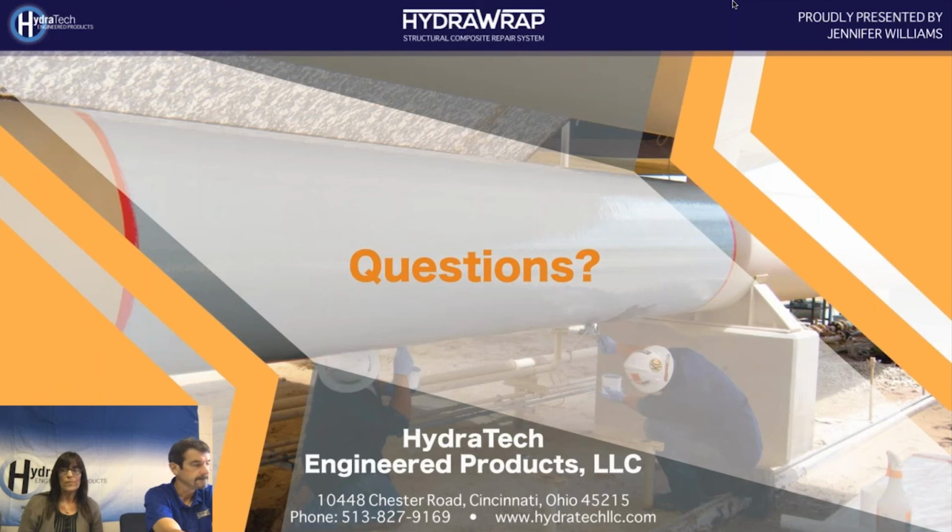All right. Jennifer, Dave Badge, I have one more question. Have you guys done this on new construction, where typically in water valves, they'll bring the water pipe up through a structure, basically a manhole, and at the bottom is the weak spot because water inflow gets in there, it sits in there, and right at the top of the pipe, at the interface between the pipe and the bottom of the manhole, that's where it starts to rust. Have you done these on new construction for that piece, that riser piece that comes up inside the manhole?